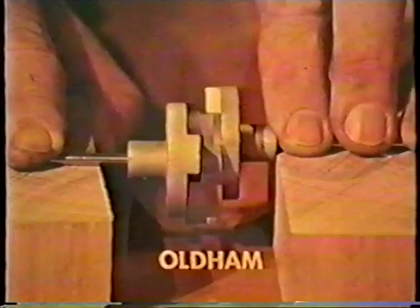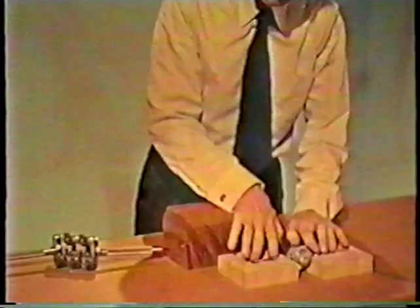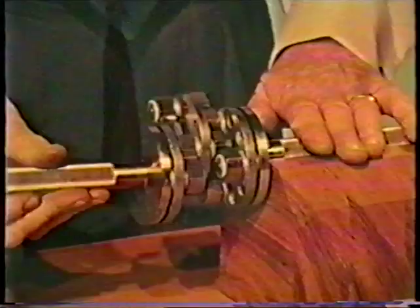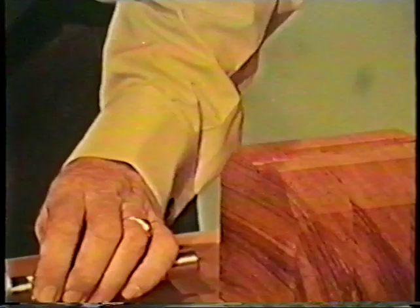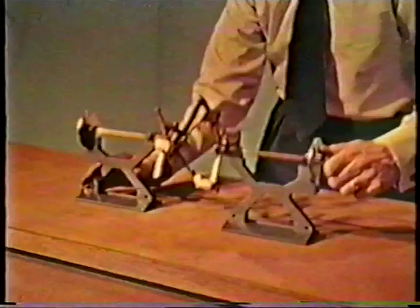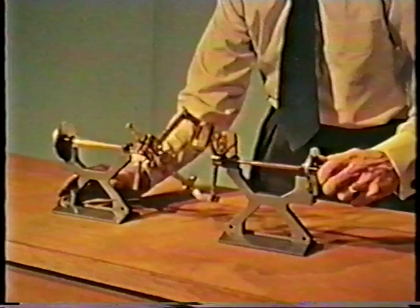At the present time, there are, I believe, only two commercially available parallel shaft couplings — the Oldham and the Schmidt — both non-plunging. Naturally enough, both of these comply with the general theory. However, the theory now reveals dozens or even hundreds of promising plunging geometries, all entirely new.